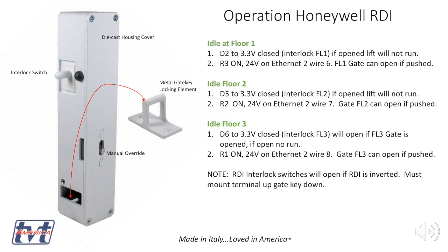I think they've designed a decent product, and the Smart Lift system just plugs in. It's as easy as plugging anything else in to add an interlock to a floor. There's no special wiring or anything required. You just plug it into the call station, select the floor that you're at, and you're done. So we have a detailed Ethernet map, and it'll tell you which line is carrying what signal, and all the way back to which pin at the control station it's running.